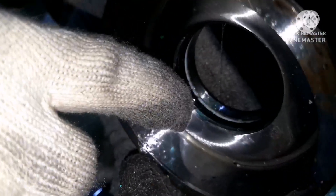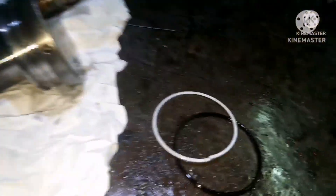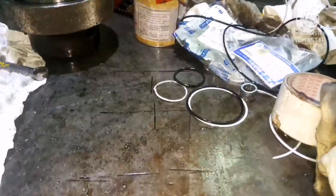On the cylinder also you can find a backup ring and o-ring. Usually what happens is when the backup ring or o-ring gets damaged, the jack will start leaking. Remove the o-ring and take out the backup ring — the backup ring is usually made of Teflon. You can see here the backup ring on the cylinder is damaged, and that is the reason the jack was leaking. Both the o-ring and backup ring are damaged, which causes oil to leak out when the jack is pressurized.